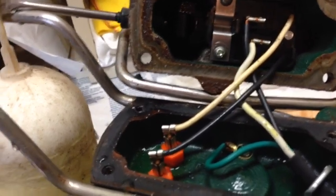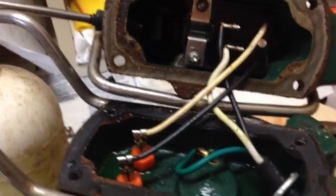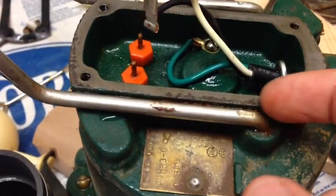From the instructions, you want to undo all the wiring, then do the gasket, and then rewire it. Otherwise you won't be able to get the gasket back on. The top is off and the switch is unhooked. I took the gasket off - it came off pretty clean, just a little bit of residue.